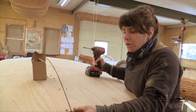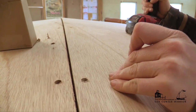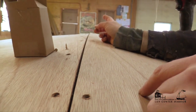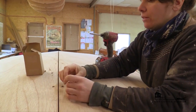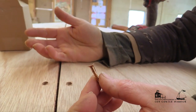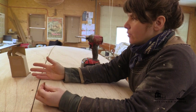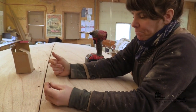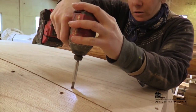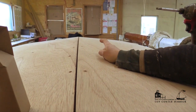An important thing to keep in mind when you're drilling for these fasteners, you do want to countersink them quite a bit. When you put on the keel, you'll be flattening out a 7/8 wide span almost all the way up forward. But you do want to countersink. If you use silicone bronze screws like these, they are somewhat kind to block plane blades and the like. So you can cut these without destroying your blades, but still, if you can avoid doing that, you might as well. And I've staggered my fasteners, which you can see on the other plank, inboard, outboard, in an alternating pattern.